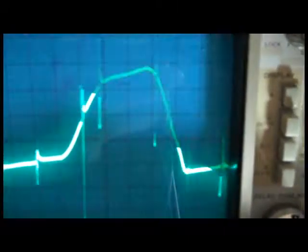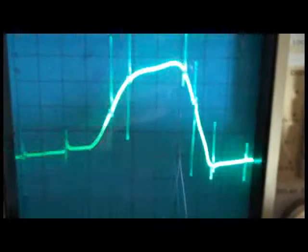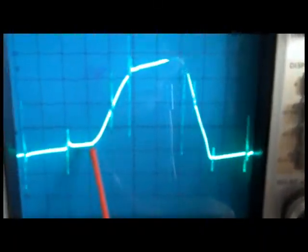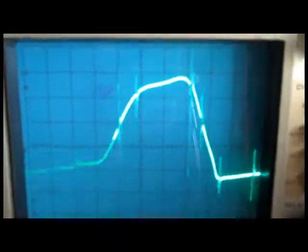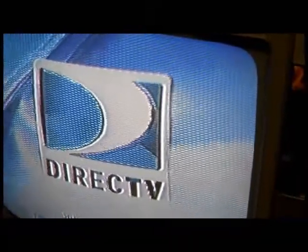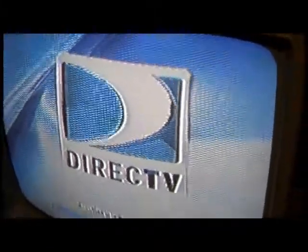I'm pretty happy with the performance of the TV too — fine tuning works perfectly, color and sound follow each other, so this turned out pretty good. I still have a gap over here that's not ideal and I don't have the sound bump; I don't know what that's about. But the two markers are about at 50% so this looks good enough — I'm going to leave it like this because it's working really well. To finish up, I was trying to adjust the 4.5 MHz trap to get rid of what they call a beat pattern — a cloth-like pattern you get when you turn the fine tuning right up on edge — and it was having no impact at all. So I'm going to pull the chassis out and see if I can figure out why — whether that coil is bad or there's a bad resistor.